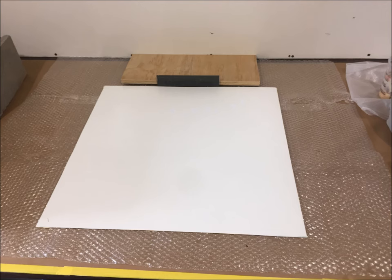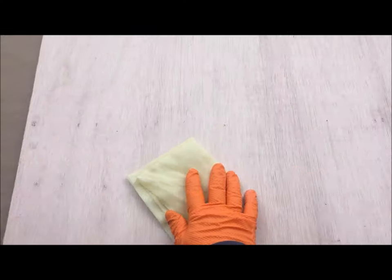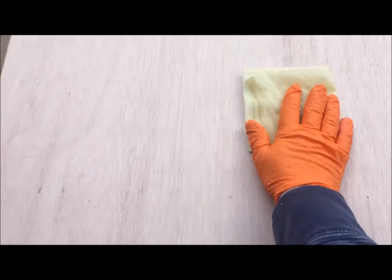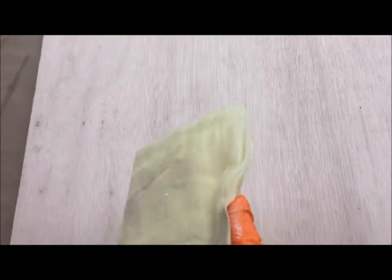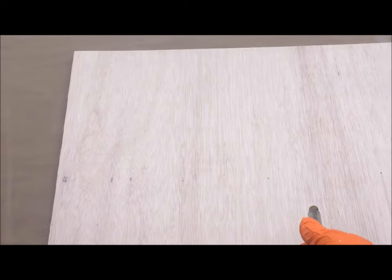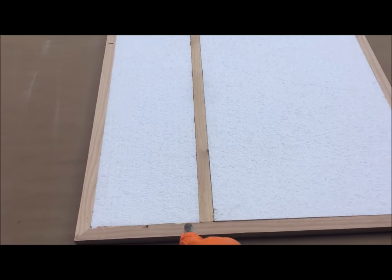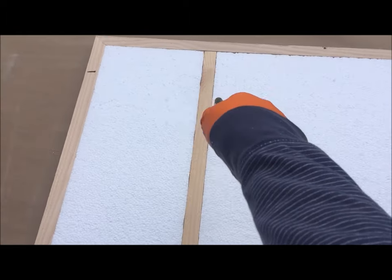The prepared Phylon is then placed into a fixture set on another table with the bonded side up. We then move on to preparing the plywood by sanding it with 220 grit sandpaper, followed by a tack rag to remove any dust and debris left in the pores of the wood. This is followed up with compressed air on both sides of the prepared plywood. Preparation of the styrofoam and framing consists of a gentle pass with compressed air.